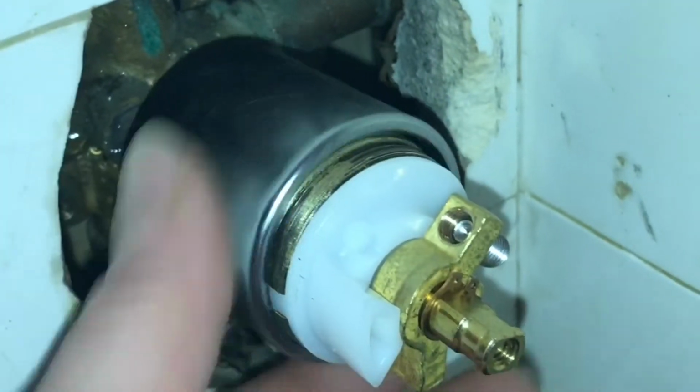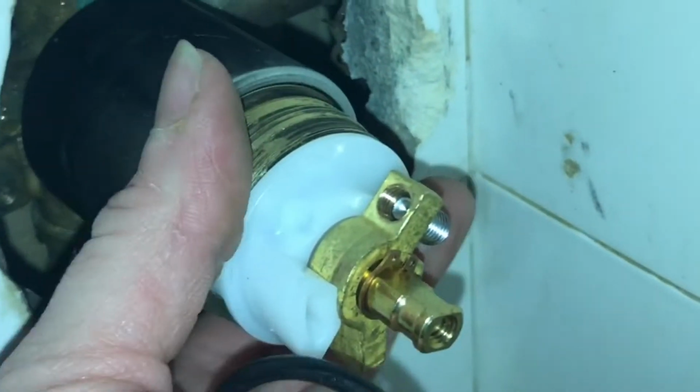And now I have this other piece that slides on, and it's kind of self-explanatory. The edge without the ring goes on first, and then there's this little lip that catches onto that rubber gasket that we replaced over the old faucet. That's going to go on, and then we have that final piece that really secures everything. So yes, I had to put everything down. There we go, that slips in there, and as you can see, that rubber ring kind of catches there.